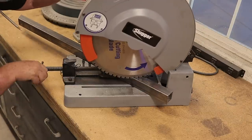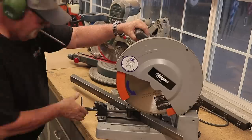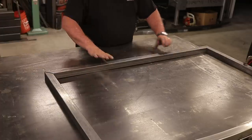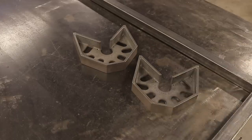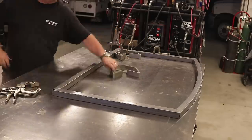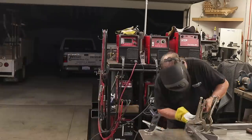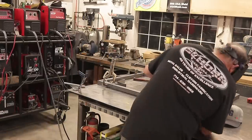These are the pieces for the 45s that I need for the bottom section of the gate — I'll be cutting three of them: the bottom section plus the two side rails that join in. Those 45s are nice and clean and true. And these are my Fireball Tools — I've had these for about a month now on my latest project, and these things make everything go so much faster and smoother. You just drop them into place, clamp them, and everything's already at a perfect 45 for you. No guessing at all — just put everything in, clamp it down, and start tack welding.